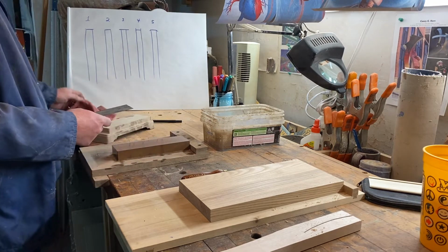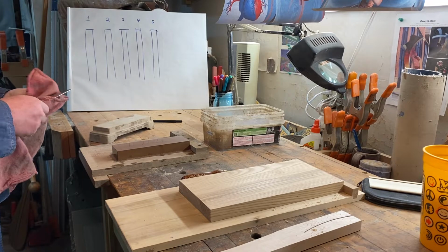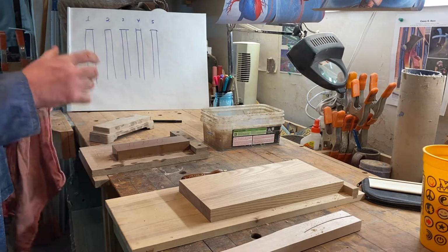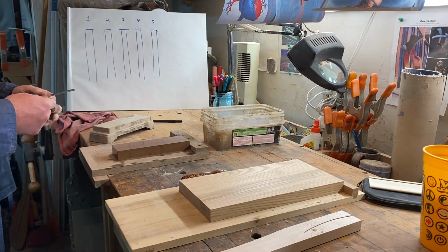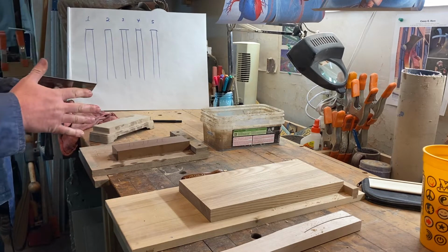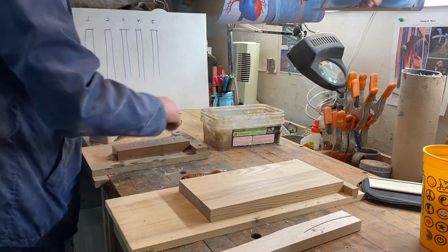All right, getting back to the grit of the stone, I'm using my 800 stone. One could definitely use a finer grit, and that's fine. It ultimately is just going to make smaller, smaller, smaller scratches on the wood, and that's ultimately what we're talking about. But if you're used to getting a beautiful surface quality off of a scraper using a file to sharpen, this is going to be night and day from what you have been doing or used to.